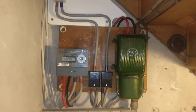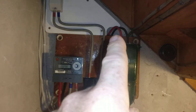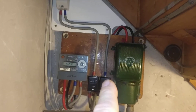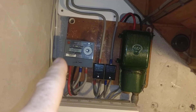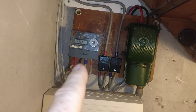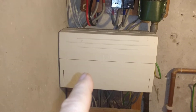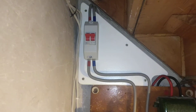So now the wires flow from the top of the service head — the live and the neutral, the red and the black tails — come out of there, under the existing mounting board, and you can see they come up and go into the electrical meter. Then from the meter you can see the two tails coming out. Rather than going to the consumer unit as they used to, they go under the first board, under the second board, and then if you look they come down at the top and go into the isolation switch.